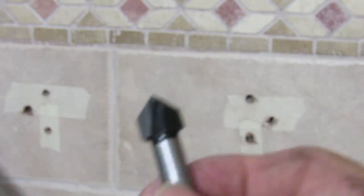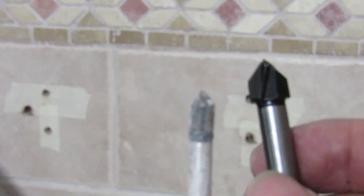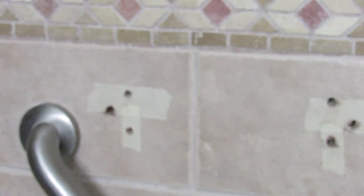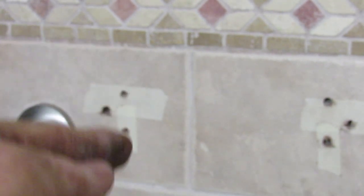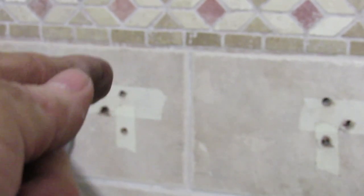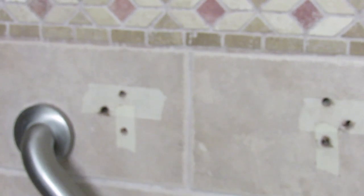I have a larger bit now — you can see the size comparison. I'm going to try it on one side, right there. Those two holes where I hit a two-by-four stud, I don't need to make a big hole — I'll just use a regular screw. So now I'm going to try the bigger bit on the other holes. It seems like it's been easier going from the smallest to the largest, but honestly this tile is really hard.